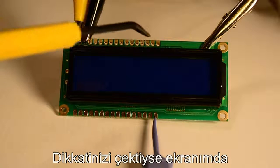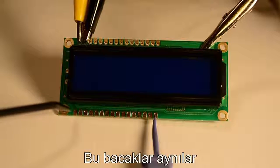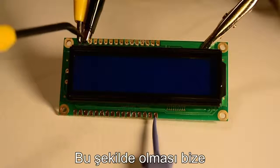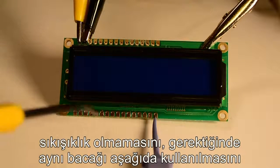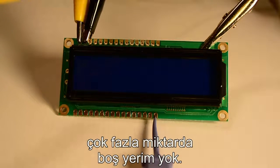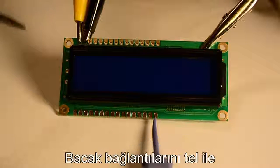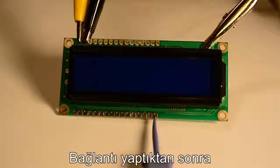On my LCD screen I've got 16 pads up here and 16 pads down here. You can imagine them as the exact same pad because they actually are connected to the same pin on this LCD. What that allows for is if it starts getting really busy up here with connections, instead of using all the connections up here you could use a couple down here — useful if you're putting it in an enclosure with limited space. These pads are what you connect with a wire to the pins on your Arduino.